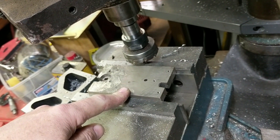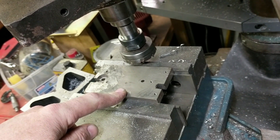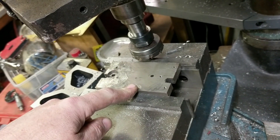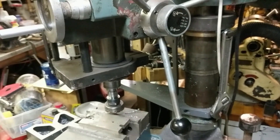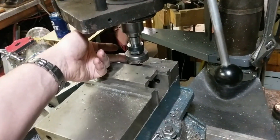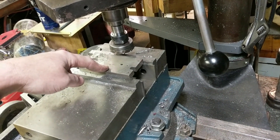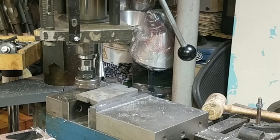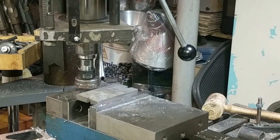Because the piece needs to have the half nuts sliding inside of it, I think cast iron is a good choice. The first thing is to bring this down to thickness — the piece needs to be 300 thousandths exactly. This piece is currently 457 thousandths, so I've got it mounted up in the mill with my homemade face mill, and we're going to mill off 157 thousandths. Step one will be to touch off the surface and set our Z axis to zero.